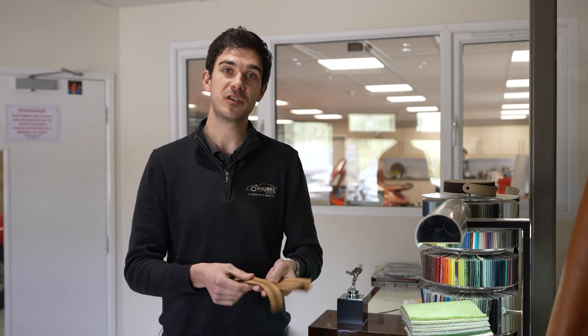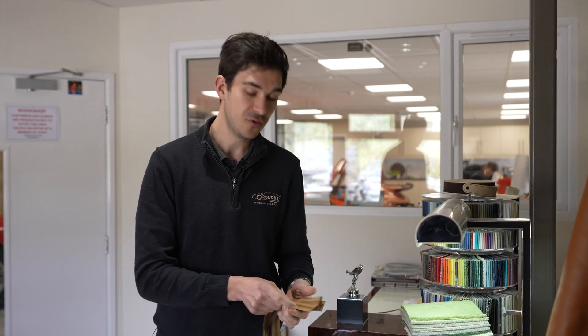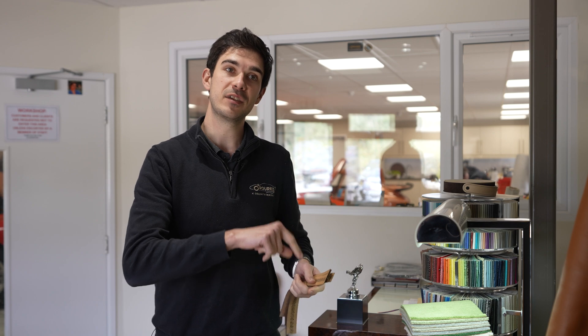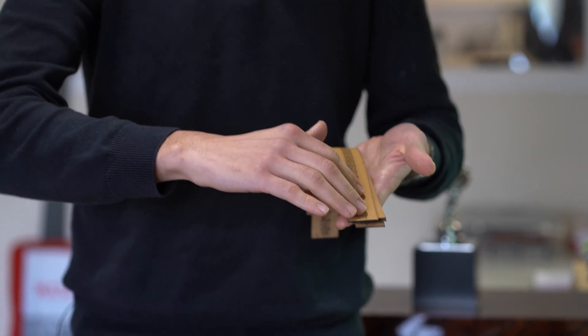Here we are with the strips fresh out of the laser. They may look a little bit bigger than the originals — that's because they've got the tolerance for stitching these into the seat covers built into the size we've cut them to. This makes it a little bit easier and faster for the trimmer rather than having to cut the strips out individually. They need a good clean to remove the carbon where the laser has burnt it, and then they'll be perfect and ready to go.